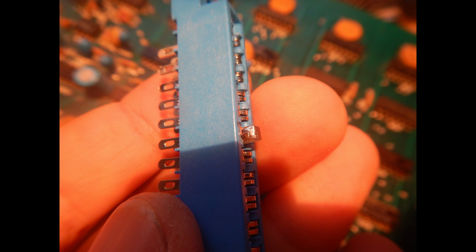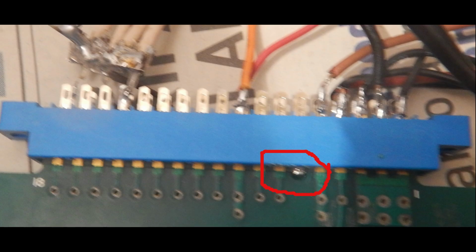At this point I mated the connector to the PCB edge, aligning the contacts as precisely as possible, and then soldered the additional pad to the connector itself. In this way, we obtain a keyed and self-aligning edge connector. The added pad has been sanded a bit to allow the connector to be fully inserted, so all is now ready for the first power on.